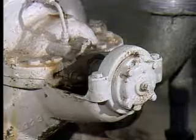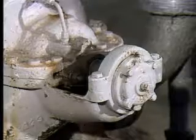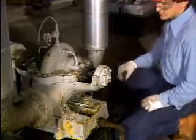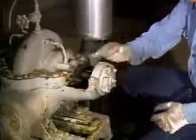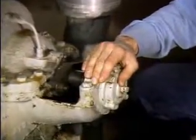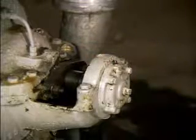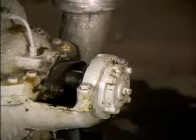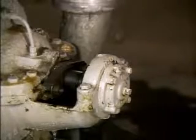Once a gun is filled, it's used to pump grease through a fitting into a machine part — most of the time, a bearing in a housing. Before lubricating a bearing, it's always a good idea to check it to see if it's running hot. The simplest way to do that is to feel the housing; you may want to try it with a glove on first. A hot housing is a sign there's too much friction, possibly because there isn't enough lubricant or the wrong lubricant was used. A hot running bearing should be reported for maintenance.